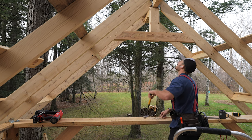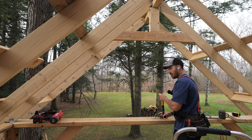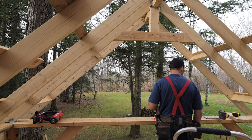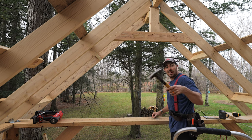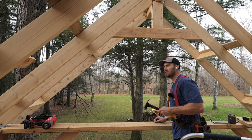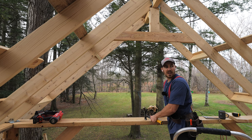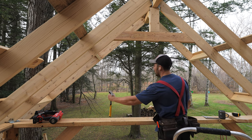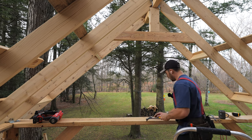This is much better — I'm able to keep my roof structure the way it was and the way I like it, and I'm able to have a window up here in the mezzanine, which is going to be sweet. The other thing it's going to do — remember how I talked about not wanting a ton of weight right in the center? As it stood, most of that weight was right there in the center. Now we're moving it out 38 inches, so it's going to be sitting more on those braces, which is nice.